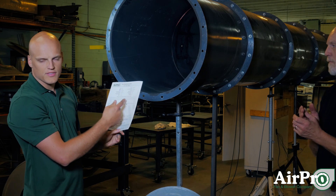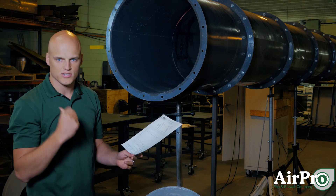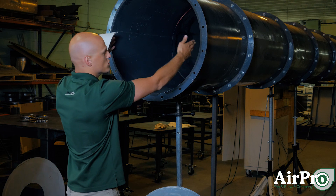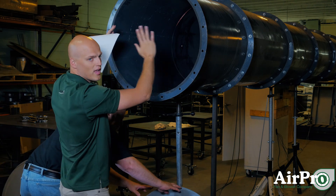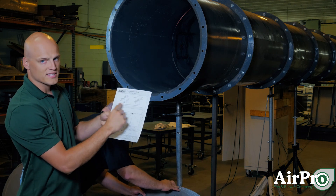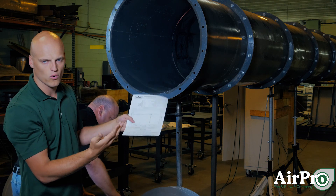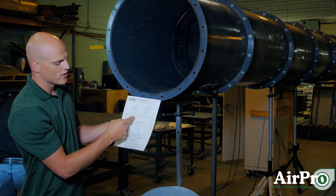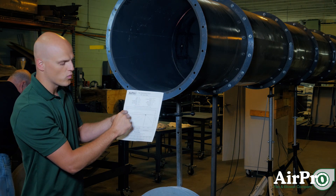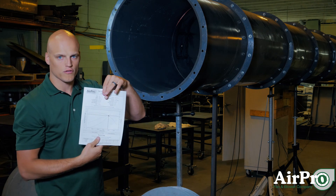The way we're going to produce the rest of this static pressure curve is with different orifice plate sizes. The orifice will go from wide open to smaller to smaller until it is completely closed off. On this plot you'll find there will be between 10 and 12 data points depending on the orifice plates used. Those points go onto this raw graph and we fit a curve to those points — and that is the fan curve you're looking at.